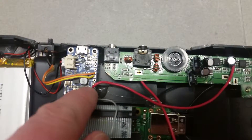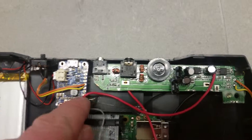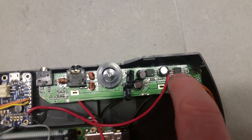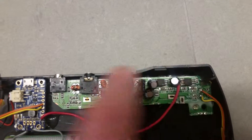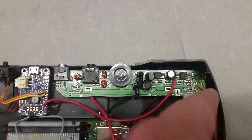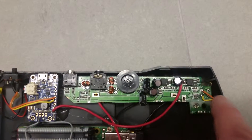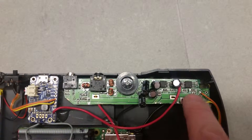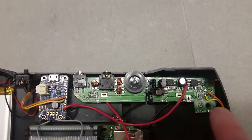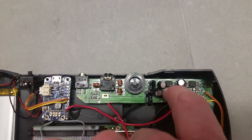The wiring is a little interesting. This is the positive output from one of the many outputs of the power boost, and the 5-volt line runs over into pin 6 on the LM386 — that's a positive voltage. As long as this has got power, the board distributes it to every other active component. This is the actual line out from the Raspberry Pi, wired to your left and right in. These two capacitors are decoupling caps in front of the amplifier — I left them out and wired straight in. The audio signal travels straight into here, hits the volume potentiometer, and then runs into the amplifiers.